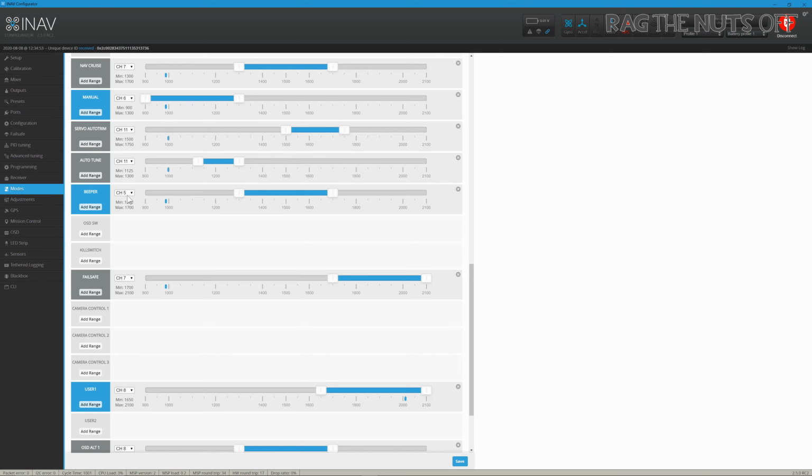We would do add range, and then we'll choose our channel, which was 8. And I only want that to happen when we are high, which is flaps. There we go. So when I move a switch, or your chosen switch, from your channel to high, and of course it could be low or anywhere in range in there, that's when the beeper is going to kick off. And of course you would then hit save.